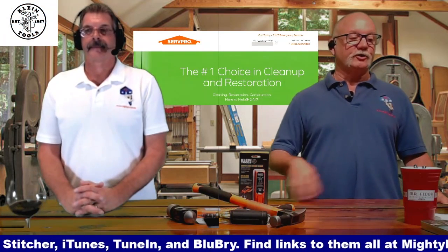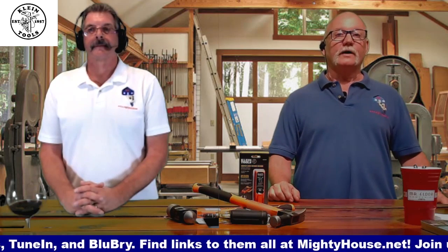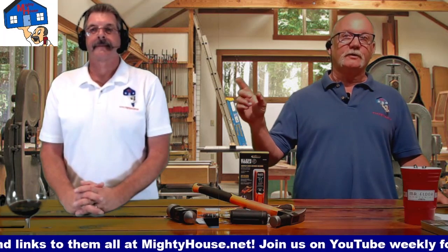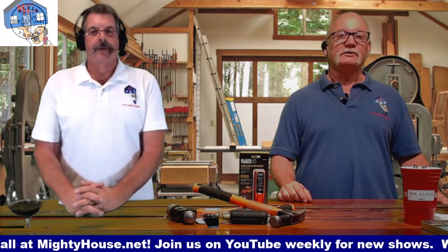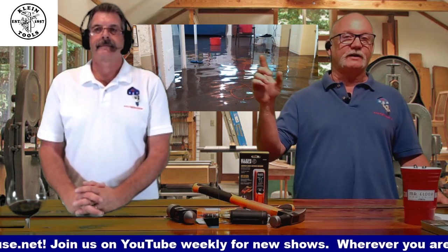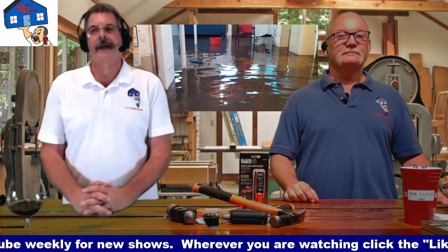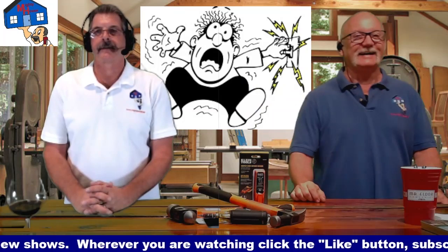A couple things to do when your basement's flooded, and a couple things to look for when it does flood. And again, we're just going to hit that electrical safety one more time. We don't want to walk down in the basement, especially if the power's on. So if you see an extension cord like that, or it's flooded and you know you've got outlets or any type of electrical devices below that water line, do not walk in the water, because if you potentially ground yourself, there you are.